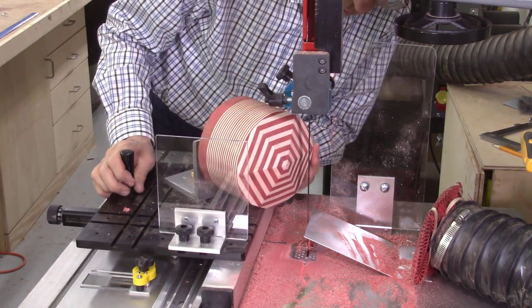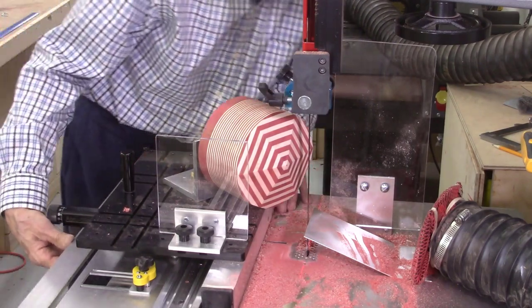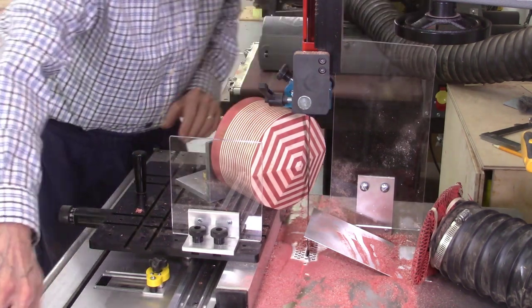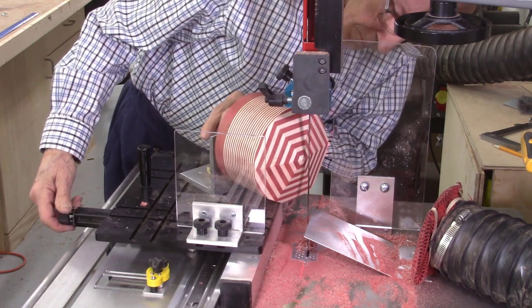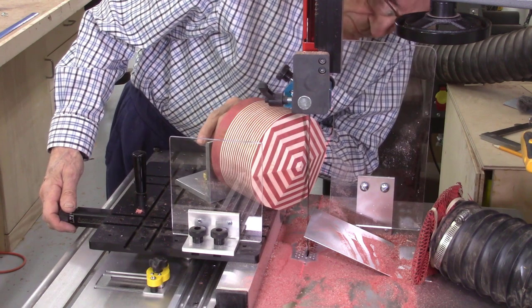I mark where I want to cut. I have to move the table in to get to that position. The cutting positions for each subsequent layer is somewhat arbitrary, but I usually set the distance to 1/3 to 1/4 the remaining diameter of the wood block. You can always cut more off later. Here you see me fine-tuning the cutting position with the Accu-Slice index wheel.